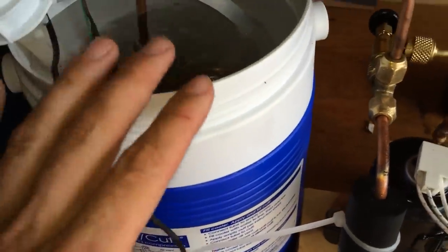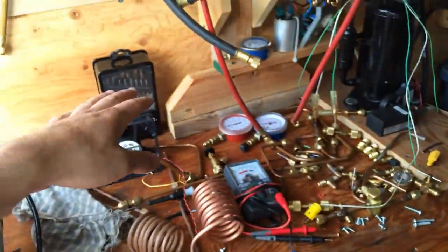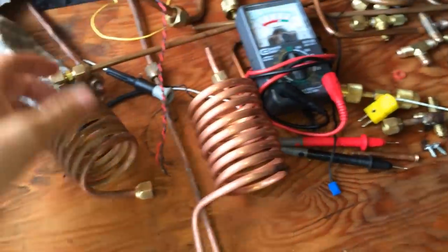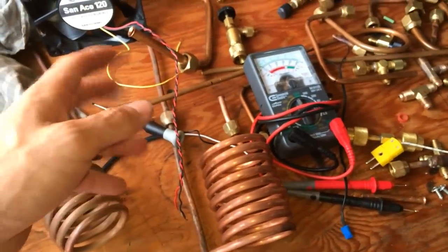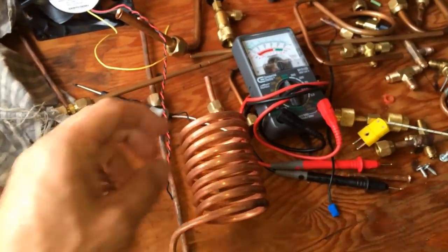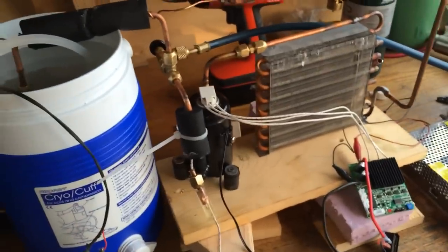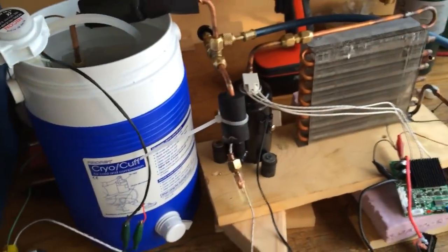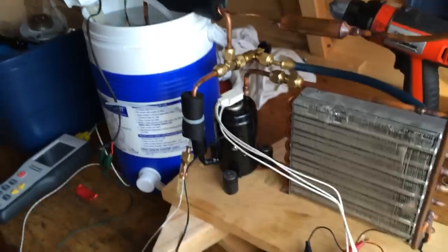There's another video about that, and I'm hoping to do more stuff with it in the future. There's going to be this bucket raised to an elevated position up high, and a lower bucket down low with a coil on it. I have some borosilicate tubing going in the middle with hose clamps and rubber hose to get an indication of how much migration of liquid, slugging, bubble pumping, and all that is happening. It's just a fun little project. I want to see how effective the thermosyphon is and I'm looking to operate at lower temperatures, working in refrigeration temperatures because I have some projects down the road.